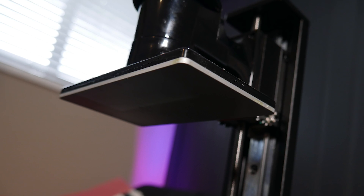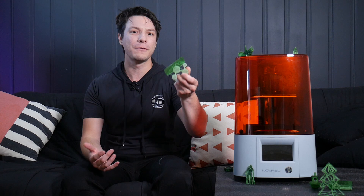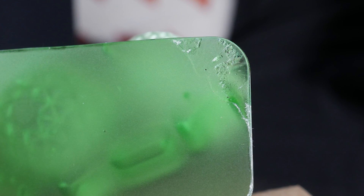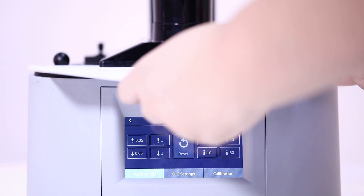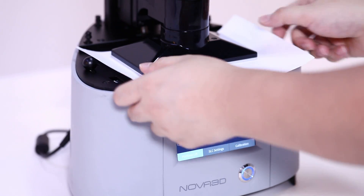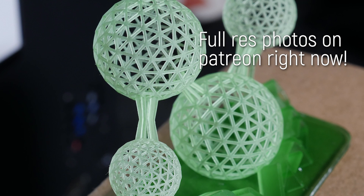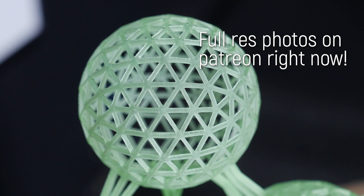This is great to help you get up and running quickly, and my first test with the demo print kind of worked but revealed first layer adhesion was poor — it wasn't close enough. Thankfully, you can calibrate that easily enough using the good old piece of paper trick and we were good to go. The demo model is like a tiny geodesic dome moon base — it's super cool.